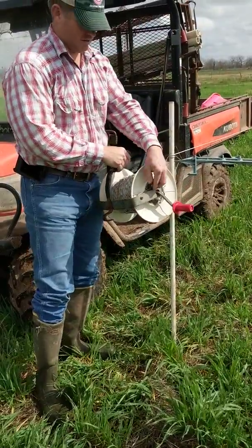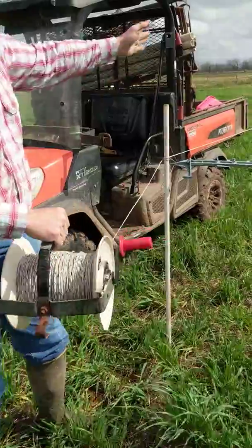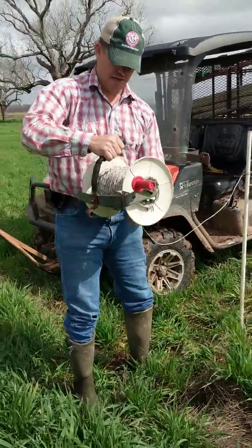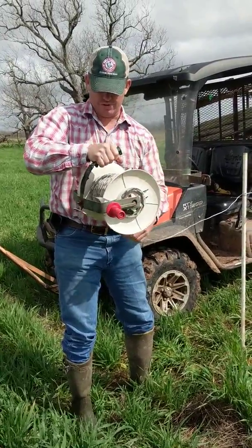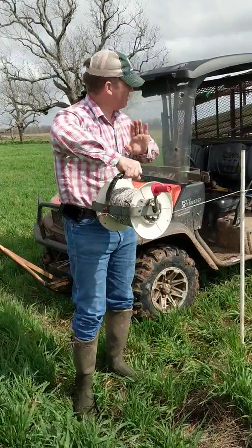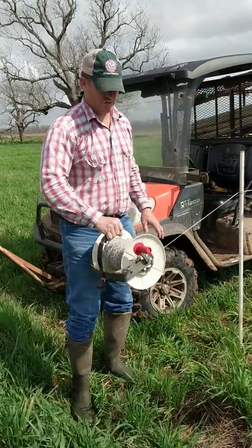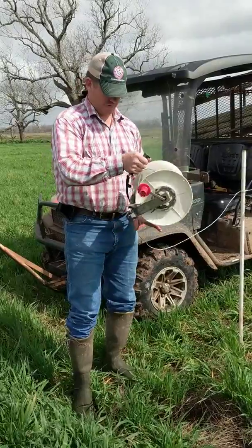To make this hot for a semi-permanent or permanent electric fence, I would just take this wire, wrap it a time or two around the hook, tighten it up to where I want it, and then hook that on the fence — that makes the connection really solid. I've seen people lap it over the fence and set the reel on the ground; there are a bunch of different ways to do it, but this works pretty good for us.